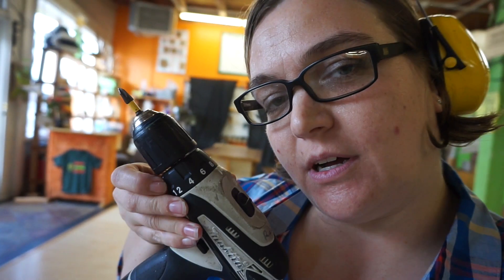This is actually exactly the intended purpose of the torque collar on a drill. It will stop the drill from going when it needs certain resistance, so you can keep it from going too far and having the head of your screw crack the wood when you're close to the edge. In this case, I don't want it to go too far, crack, or go through the other side.